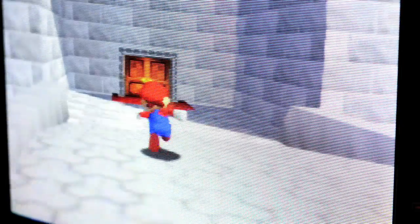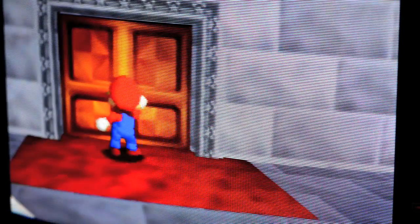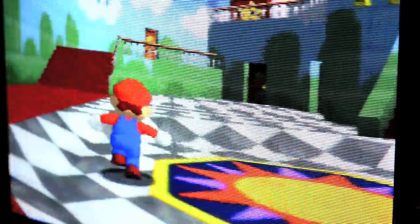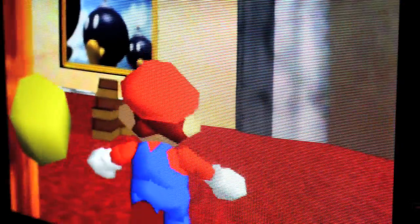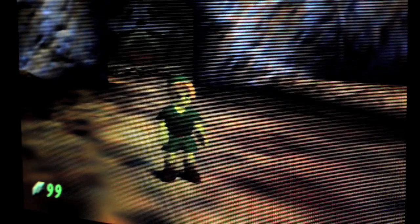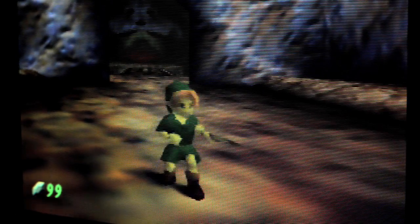I like to think of this filter as something like dithering on the Sega Genesis. It only works if the picture is not clear, like composite. But when you add RGB using the THS7314 circuit and with pure composite sync, you can see what the N64 was really hiding under its hood. It's like a filter you would use on Photoshop, and not a good one.